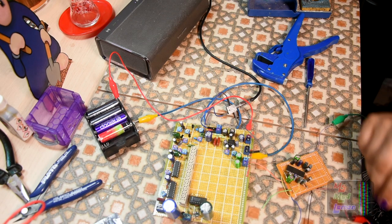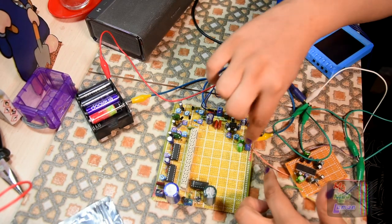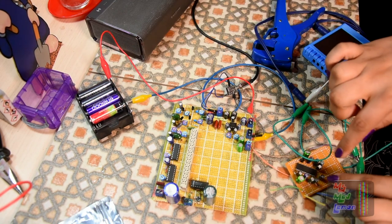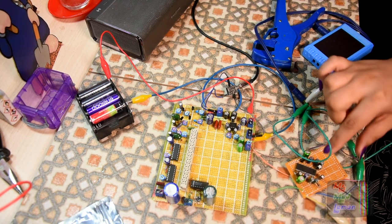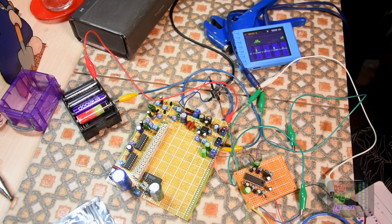I've always done this, I don't know why, it's stupid. It really is. Okay, so I'm gonna test. This is connected, outputs are going into the input of the Dolby module, which is powered by a separate 5 volts. And this is minimum 11 volts, maximum 17, so I'm powering that using the power pack. Okay, well, at least it's going through.